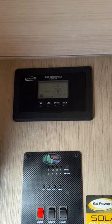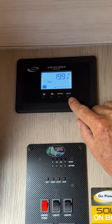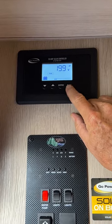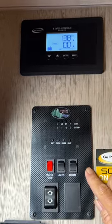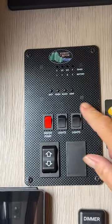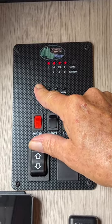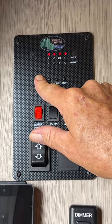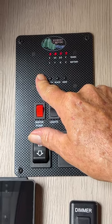At the very top you have your solar panel readout to show you what the solar panels are putting out to the battery. You can go to where it says 'back' — it changes and shows you all the different things it does. Then we're going to drop down to the monitor panel. Check your battery life — it shows fully charged, but that's not really accurate. To get an accurate reading of the battery you need to have the 110 line unplugged; anytime it's plugged into 110 it's going to show you fully charged.